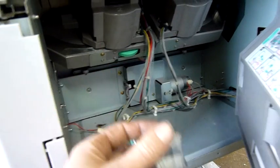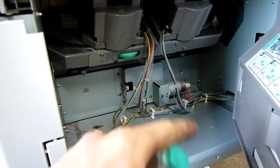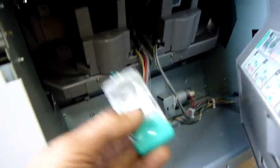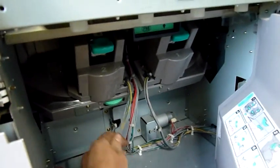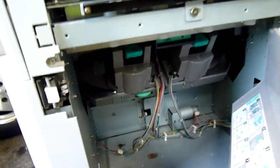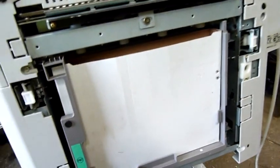It's not like a staple gun or a regular hand stapler where the staple's already pre-formed — this does it all automatically. They're a pretty cool little unit and I should be able to fire them off without having to run the PLC or the controls. I should just be able to rip this loom out, apply power to the right motor and solenoid, and it should fire off. We'll look at that in a separate part, but for now I just want to strip this down and get it out of here — it's taking up way too much room.